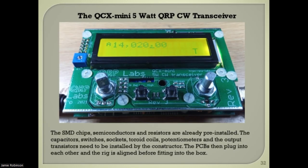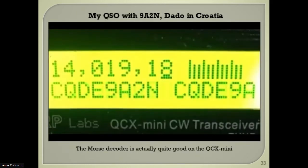There is the kit assembled, ready to be put in the case. It's very tight to fit — I had to file out the aperture for the BNC connector and enlarge the mounting hole before it would go in properly.